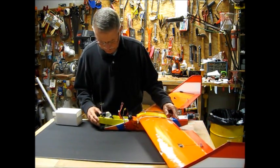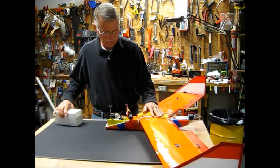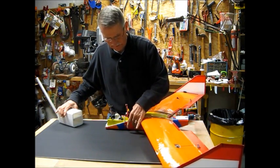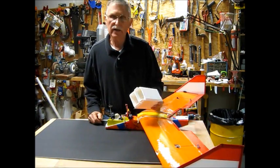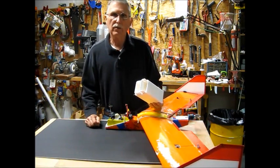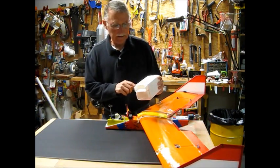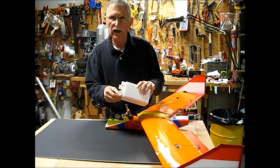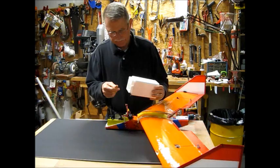So I wanted to preserve Ed's system of trays in the fuselage. The Synapse is roughly 2 inches by 2 inches. It comes out to about 2 1/4 by 2 1/4 on the fuselage size. I recognize that with the 808/16 and its 90-degree plug, I would need a wider fuselage and one that was taller. So I designed a 3 1/4 by 3 1/4 nominal fuselage, and I kept Ed's system of movable trays.